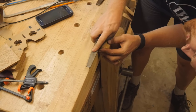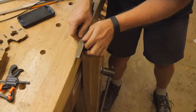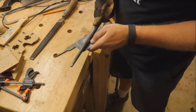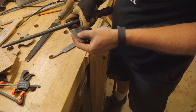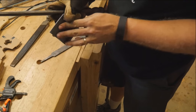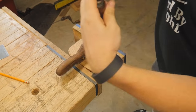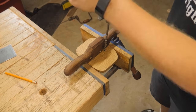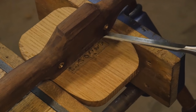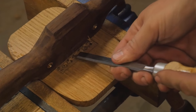After cutting it out, you need to go through and file everything smooth and give it a little bit of shape. There needs to be a 45-degree angle on the back of it. After shaping and cutting it, you can sharpen it — I did a video also on sharpening and using a scraper plane recently, so that is covered in another video. Once it's glued, we can go back and cut out the mouth. I started by drilling several quarter-inch holes all the way along the mouth to remove the majority of the waste, and then I can come in with a chisel and clean out everything. I could use the handle as a registering surface to cut down so it maintains the same angle all the way through the sole.